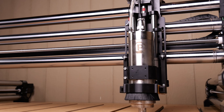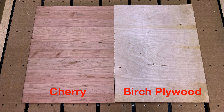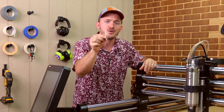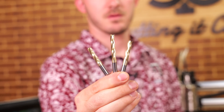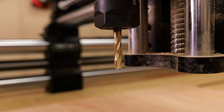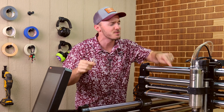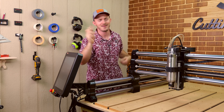We're going to be spinning this spindle at 24,000 RPMs, cutting through two different materials — cherry and birch — so we have two varying densities. We're going to be using my favorite new CNC bit, the Golden Boy. This is part of the Gold Digger family of bits, and I designed these to be the fastest bits on the market. They're meant to cut fast and stay sharp, so this bit should handle anything this machine throws at it. But who knows? Let's get right into it.